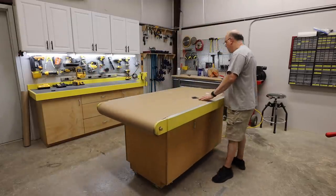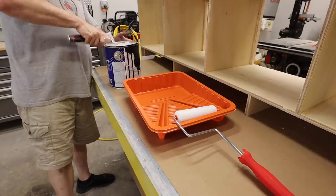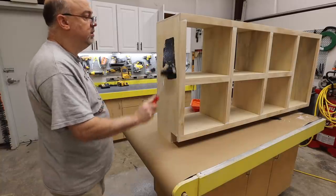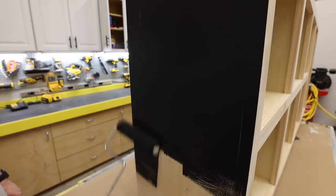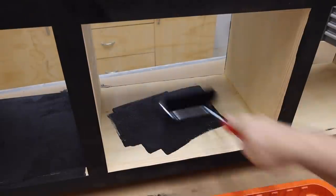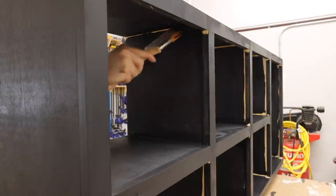Now it's time for some paint. I went with a deep black called Tricorn Black from Sherwin-Williams — I thought this would give nice contrast from the light gray wall. I want all of the color of my set coming from the items on display, not the furniture or walls. I decided to roll the paint on with a foam roller. I did fill all the nail holes and cracks off camera. After rolling the flat surfaces, I came back with a small brush and did all the cut-in work.